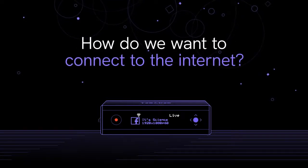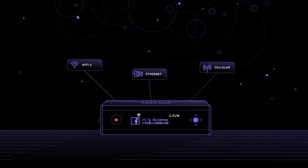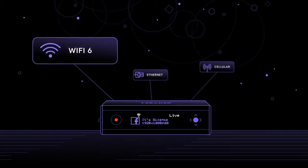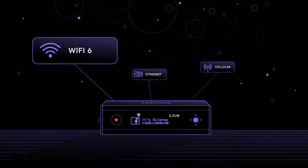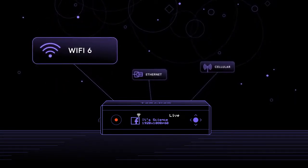We've got three options: Wi-Fi, Ethernet, or cellular modem. Each choice has its benefits and drawbacks. With Wi-Fi, it's not quite as stable as a hardline connection, but it does offer mobility. We can move the Vidiu X anywhere in the space within reach of a Wi-Fi signal. If you plan to be moving throughout the space, this would be ideal.